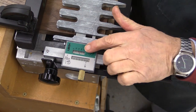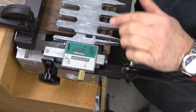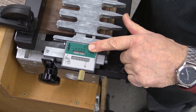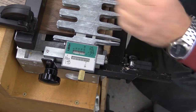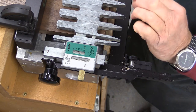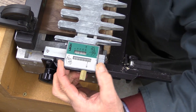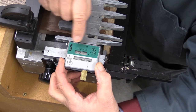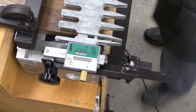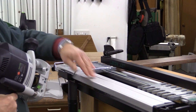I'm now going to move my front piece completely out of the way, then lower my template down so it's sitting on top of the workpiece. At either end of the finger template there are scales, and the scale we're using for this operation is colored green — green is used for half-blind dovetails. We're going to set up on this scale the thickness of the drawer sides. In my case, that chestnut is 14 millimeters. So I adjust this so that the mark underneath the scale is lined up with 14, tighten it up, and do the same at the other end. Now I'm all ready to go, with the vacuum support in place.